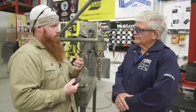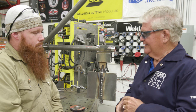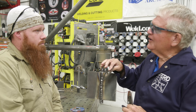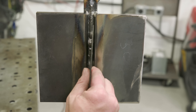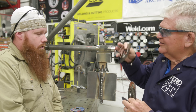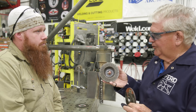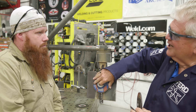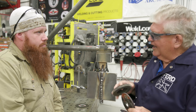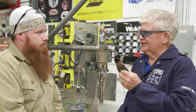You have to understand the way each wheel is designed. The cutoff wheel is designed to cut, but it's so thin — especially the 0.045 — that you can't get enough profile. You'll make a bunch of little cuts but it won't really work for you. The segmented flap disc, the zerk wheel, is really designed to run flat. There's nothing on the side to wear things out, so it won't let you get in to where you want to be.